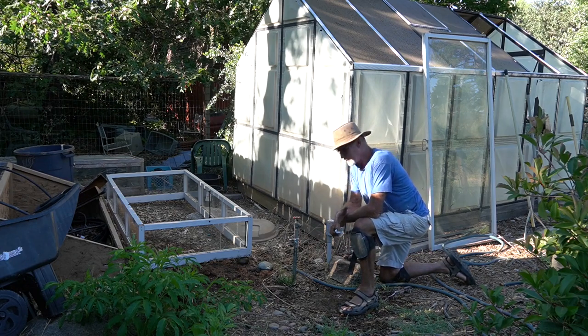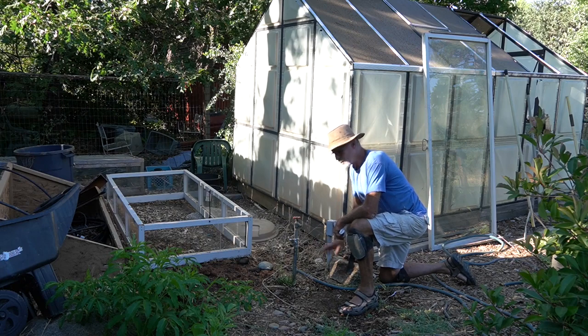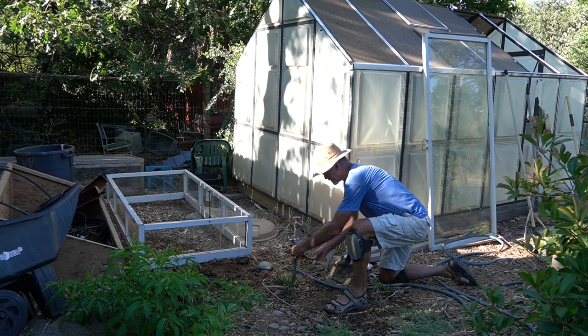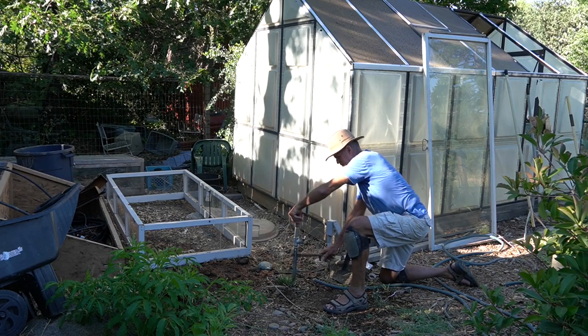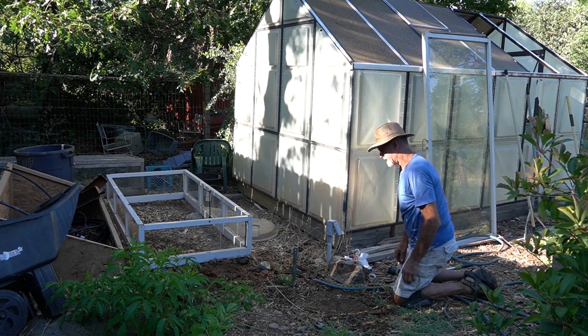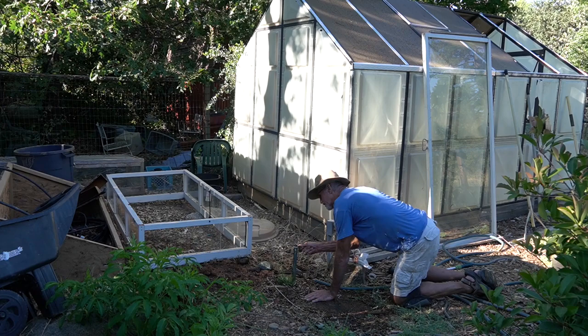All right, well, I got the water off. I'll take that off of there and see why it's leaking. I've never had this problem. Usually water pipes, Teflon tape, little pipe dope, 100% infallible. I know, my fault. It's almost always user errors. The threads look okay, but I'll do what I should have done in the first place. Take my little wire brush and clean this old stuff off.